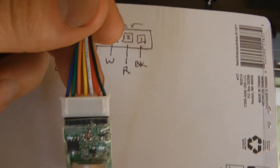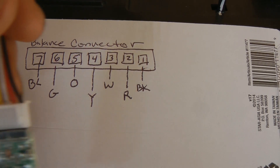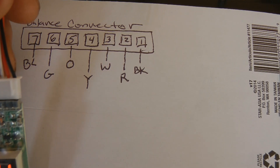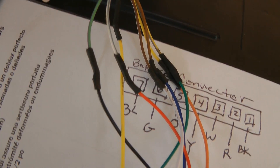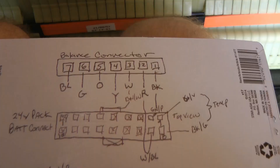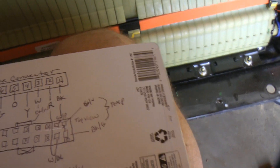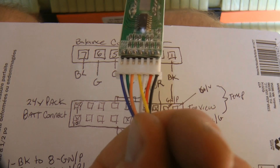Here's the connector. Here's a little diagram I drew — one, two, three, four. The colors going right to left are: black, red, white, yellow, orange, green, blue. You can see that corresponds with this connector. I'll show you where these hook into this connector here — it's hard to lay these out so you can see, so I'll draw a picture. This is the best you're going to get from me right now. I showed you what this is right here — that's this configuration from black to blue.